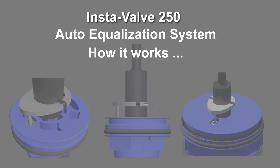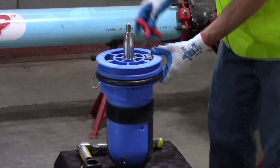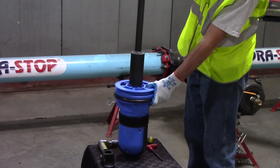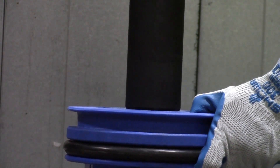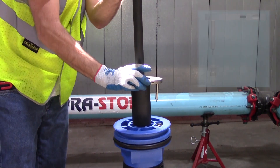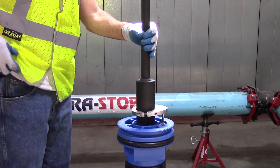How does it work? The valve cartridge is prepared for installation. Remove the operating nut and the check valve NPT plug, which is factory threaded into the Auto Equalization check valve. Thread the insertion tool onto the valve stem. Be sure the insertion tool is snug against the completion plug. The Auto Equalization insertion tool adapter is then placed onto the insertion tool, with the actuator pin aligned and inserted into the completion plug check valve. Tighten the screws and proceed with normal valve cartridge insertion.